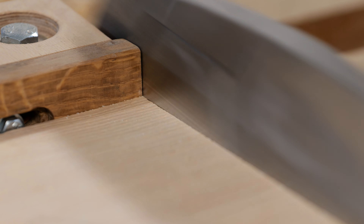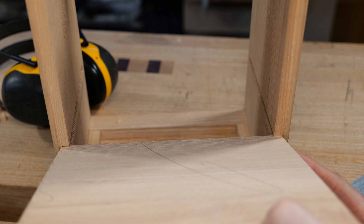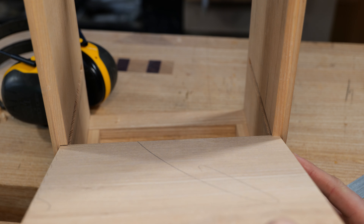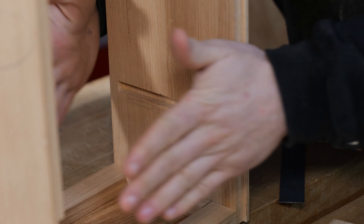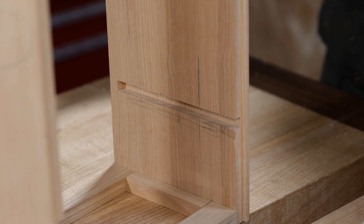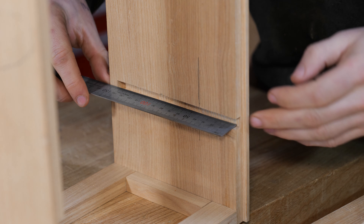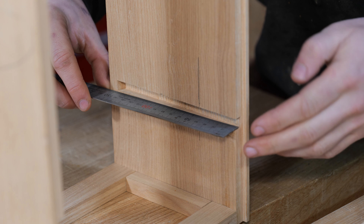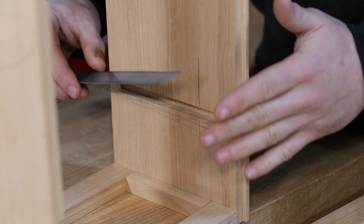I can see that the shelf just about fits within that groove — got a tiny bit of side to side movement but it doesn't matter at all because that gap will be at the end of the tongue. Next I've got to size the panel front to back, as we've only established the width so far. We're going to start this measurement from the inside of the rebate but we're actually going to add a millimeter onto it, to give us a little more flexibility when locating the shelf in the groove when gluing up.